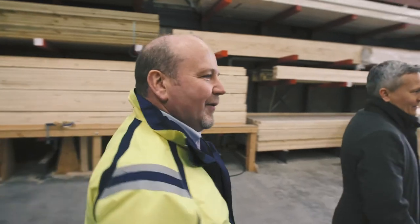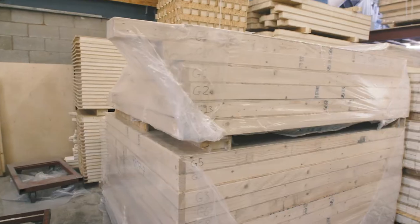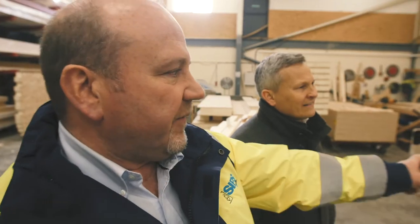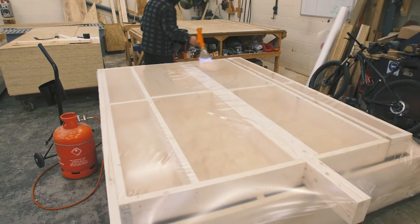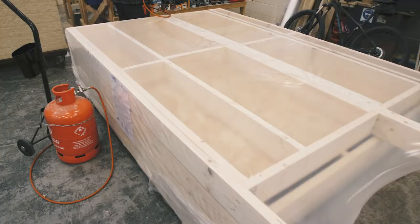These are unusual — 140mm stud internal walls. Normally they'd use standard 89mm stud, but there's obviously some serious loading here requiring a thicker wall type. Those are definitely load-bearing. They only do the load-bearing structure; the main contractor will come in and put all the other partitions in.